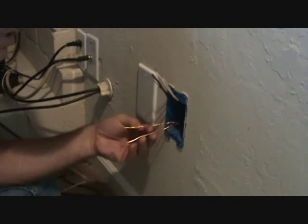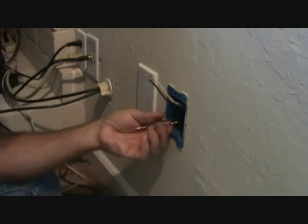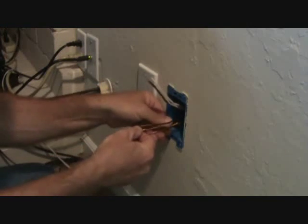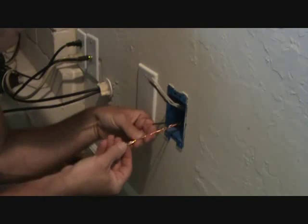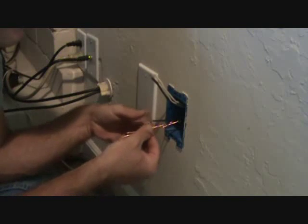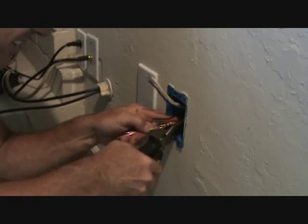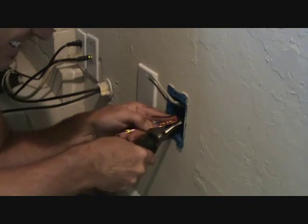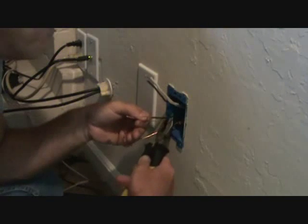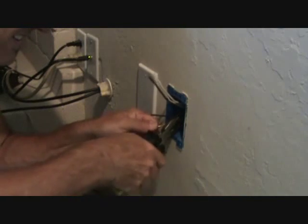I've got these two copper wires and I'm going to attach them with the splice cap. I take them and wrap them around each other a little bit, grab them with my pliers and twist — those two ground wires are now connected together. To make sure they're not going anywhere, I slide the splice cap on there and crimp it. Then I take the shortest ground wire, cut it off, leaving about three-eighths to a half inch, and fold that up.